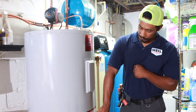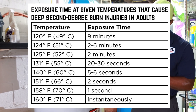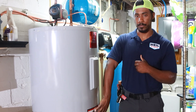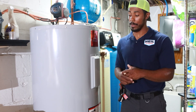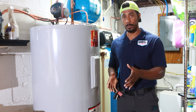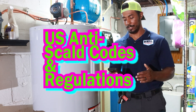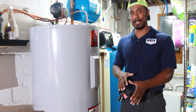Right below that, there's another chart that shows you how fast you get scalded depending on the temperature of water you have set. That'd be a good reference if you're trying to figure out the danger you're willing to take on. For the most part, 120 is where you want to set it. It is regulated by U.S. anti-scald codes and regulations, so you definitely want to stay in line with that.